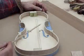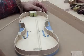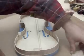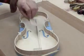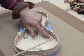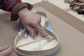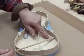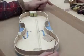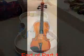The linings for the back plate have been completed. The glue is set up and I have checked all the gaps to see if there are any loose glue joints. When shaping the inside of the corner block, you must insert a little piece of wood at the bottom of that block so that you prevent yourself from damaging the top plate. I use a low angle skew straight chisel.